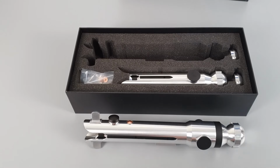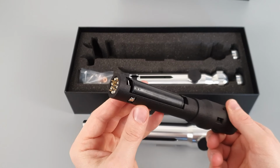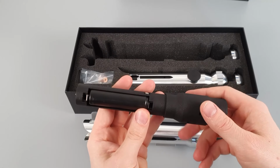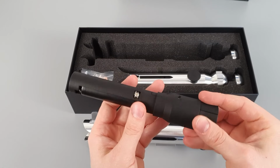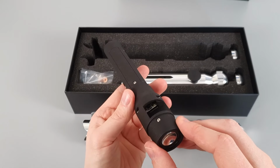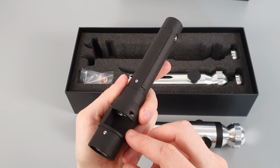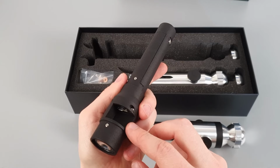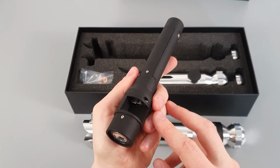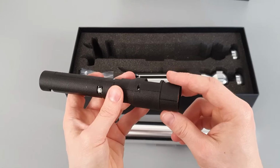Let's have a look at the chassis for the saber, which I have here. This is a NeoPixel setup with a Pixel PCB in the front. We have two switches, an 18650 lithium ion battery, the kill switch we have here, and down there we have the soundboard. In this case it is a Crystal Focus saber core. Here is a huge opening, so you can get to the USB port or the SD card if you want to change sound fonts or any configurations of the saber. In the back we have a 28mm bass speaker.